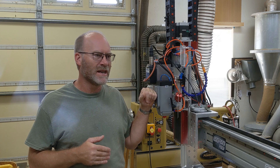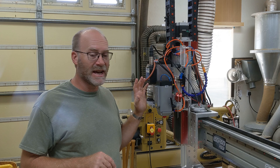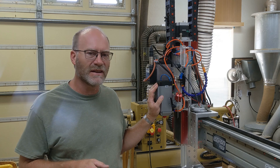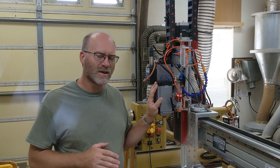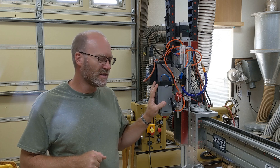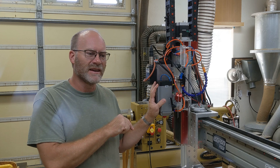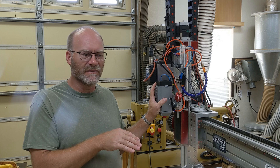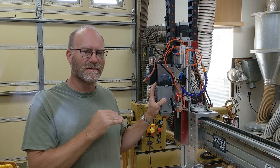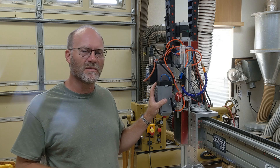This laser really will cut 5 to 10 inches per minute faster than what I had gotten on the thinner materials. And I actually was able to cut some thicker materials with the production version that I couldn't even get through on the other one. I encourage you to go watch the other video I'll link, because that one's useful for any laser as far as getting the right focal depth for thick materials.